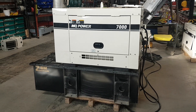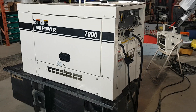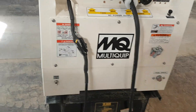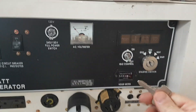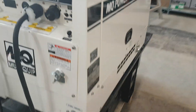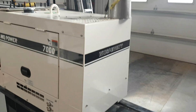Here we have a 7,000 watt Kubota diesel generator made by Multiquip. It's an auto-start setup we've put together. It's got a 20-foot cord on it for the extension and it's plugged into the system right now. It's in auto-start mode so it's going to start all by itself. Underneath it is a 60-gallon diesel tank to let it run for long periods of time.